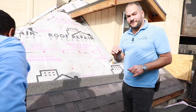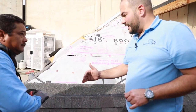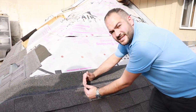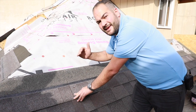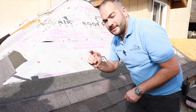When laying out your inflow vents, make sure your spacing is correct. From any hips, valleys, or rakes, you want to come in a foot and a half — that's where your inflow vent is going to start. Your cuts can actually start six inches past from there, so it's two feet from any obstruction where your cut is going to start. Let's mark out our chalk line and start nailing.